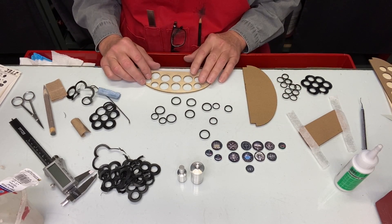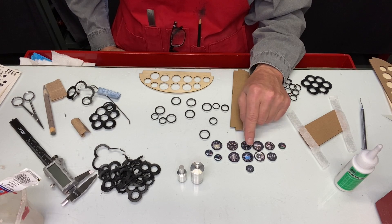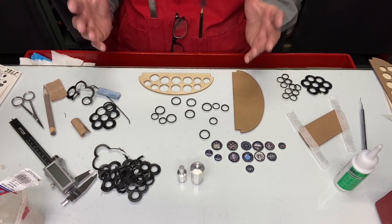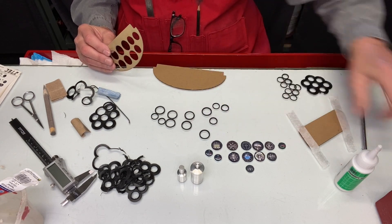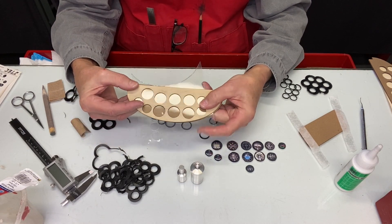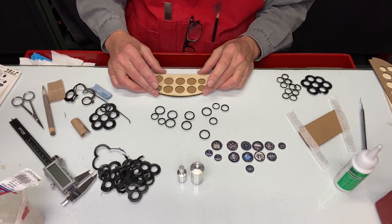Here are the instrument faces I've decided to use. These are actual photos of instruments scaled to quarter scale, then printed on glossy photo paper. I like the glossy paper because it makes the instrument faces look like they're under glass — it's standoff scale but very effective. For a super-scale airplane where you want a true glass look, you can sandwich a piece of Lexan or just about any plastic over it. Depending on the lighting it looks just like glass — really nice and very effective. For standoff scale the glossy paper is more than adequate and looks quite authentic.